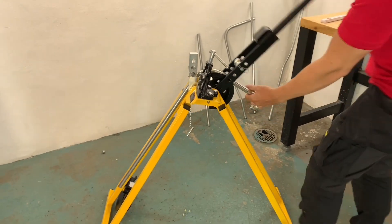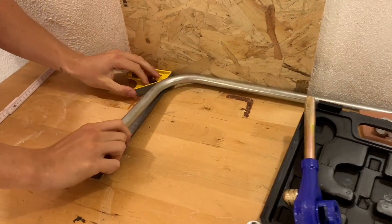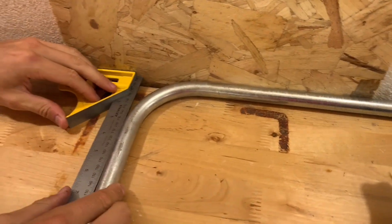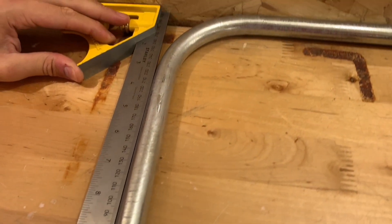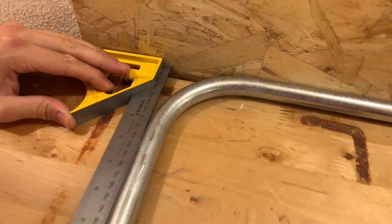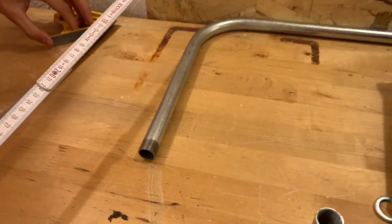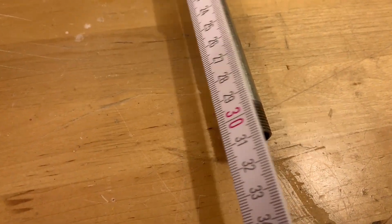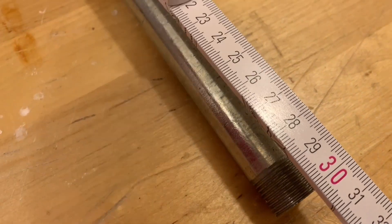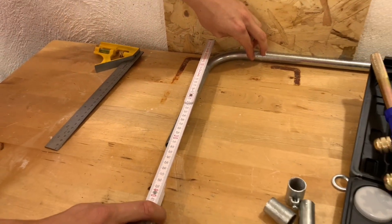That's a 90. The problem with students is they tend to go massive on the next one. So it's the same process — bring the set square back in against a fixed point, which in this case is the wall. And it should run the full length of that — so that is 90 degrees. We might as well measure from what is now the back of the bend to the end. You said it was going to be 300mm — let's see if it is. Wow — that's exactly 300mm using that technique.